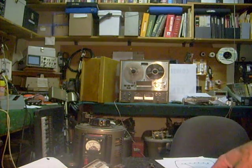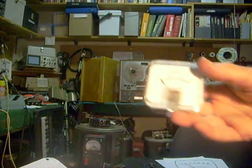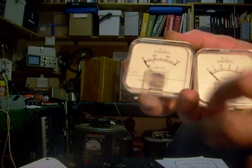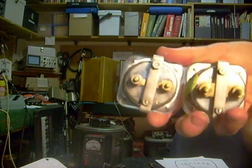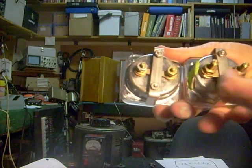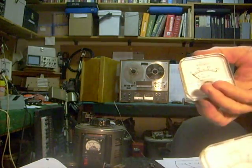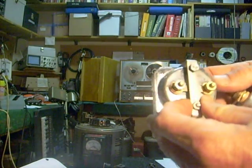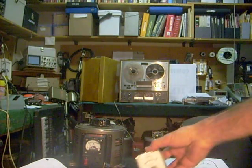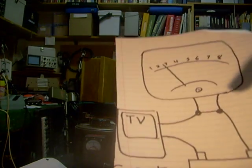One more little tip: a lot of guys just starting to learn electronics aren't all that familiar with amp meters. Amp meters are different than your conventional volt-ohm or resistance meter in that they have the equivalent of a short circuit across the two terminals. If you look at the back of these amp meters, you'll see it's actually bridged between the two terminals with what they call a shunt — just a thick metal plate. This used to baffle me when I first started, because I thought, how can this amp meter work if it's got a short circuit between the terminals? An amp meter is designed that way because it's not supposed to be hooked directly to a power source — it's supposed to go in series with whatever you're checking.